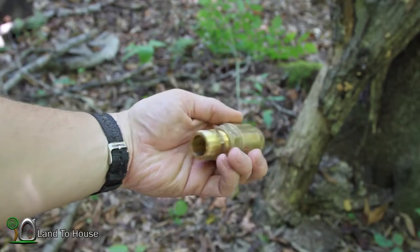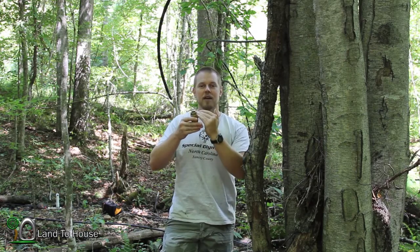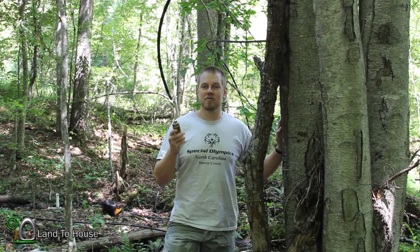And there is a workaround for this. That is with a one-way spring check valve, kind of like this one right here. What this does is it goes in line with your delivery pipe. As water is pushed through the valve, it then comes back and rests on the valve and doesn't rest all the way back down at the pump. An example of this in nature would be a giraffe. Their necks are very long, and their hearts operate somewhat like the ram pump, as far as it's a pulsing. Blood is pulsed up the neck of the giraffe, and then one-way valves prevent that blood from coming back down. It's pretty much the same principle as putting this valve in your delivery pipe.